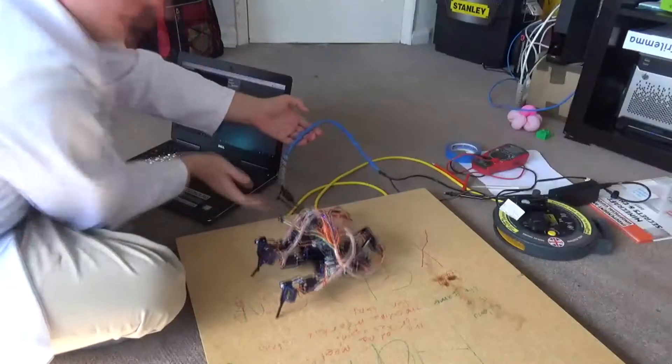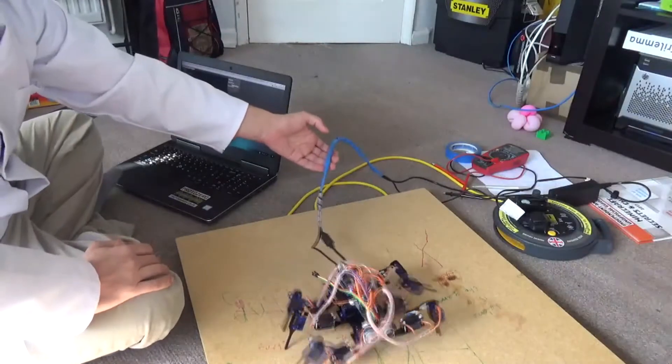So the story so far. Where we left off last time, I'd figured out that I could use a variable smooth speed to control how fast it was moving in its ant gait. Smooth speed was used to increment the angle at which the servos were moving, pulling things forward so they'd move backwards and forwards in the gait parts according to smooth speed. So my ideas revolve around how I could manipulate that smooth speed to get other movements.